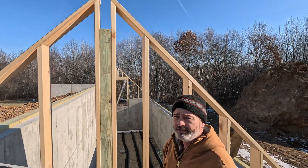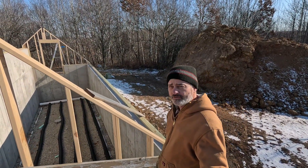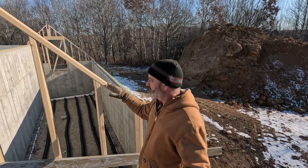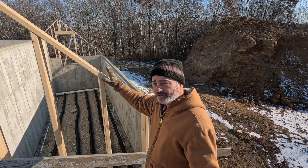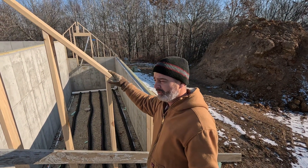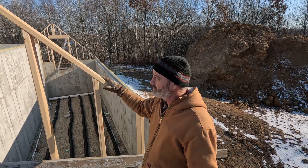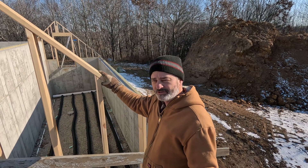I'm going to attach that beam and come on down over this way. I had a lot of angles to work with here, so it took me a while because I had to build this on site — I couldn't pre-build this wall. It's coming out pretty well. On paper I had it at a 45-degree slope on one side and about 43 degrees on the other. As I was building and working with those numbers and the existing cement, I ended up with a 44-degree slope on both sides. Being within one degree is acceptable, even for someone with a little OCD like myself.